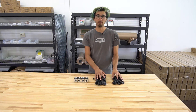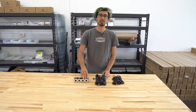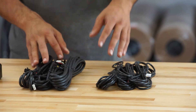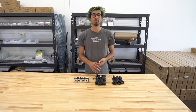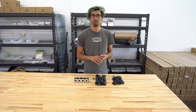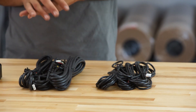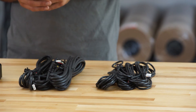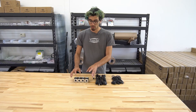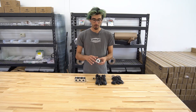There are three different cable lengths. One is 4.5 meters long and that is for the z-axis motor. Two sets are 2.8 meters long - that's for the motor that mounts onto the cross slide for the y-axis, and also the second x-direction motor mounted on the gantry opposite the electronics box. Then one set is 0.75 meters long and that's for the x1 motor on the gantry, mounted very near the electronics box. With these eight cables we're able to hook up all four motors to the Arduino and RAMPS boards and power our stepper motors.